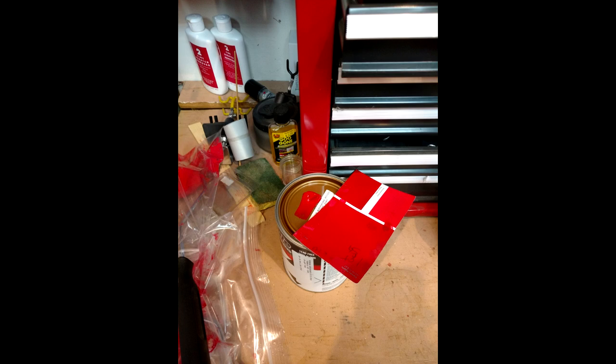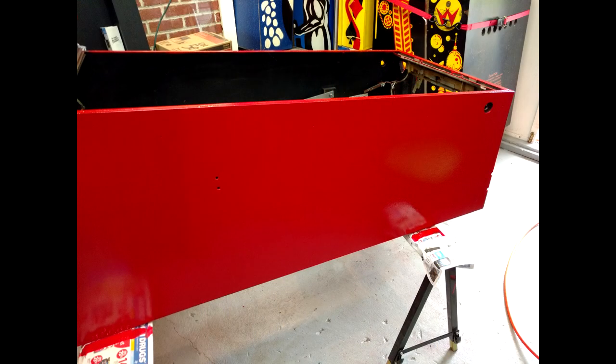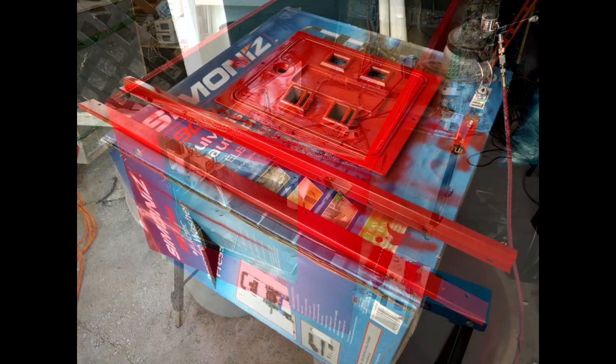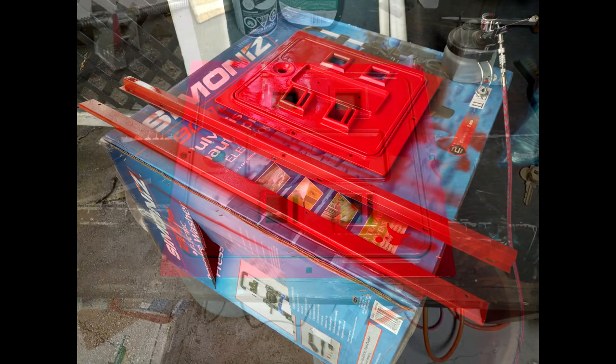So I went down to the paint store and said I really want a red like a toolbox red or a fire extinguisher red — something that really has a deep, rich color. The only thing they had was this Marine paint, an oil-based Marine paint, and it was super stinky stuff. I didn't like working with it at all, but it did the job. I sanded down the cabinet and hit it with this Marine paint and it looked gorgeous — I really liked the color a lot. There was another benefit: being oil-based, when it dries it's going to be a super tough paint, so it might actually be a really good option for repainting pinball machines — it's going to wear better than some latex type paint.